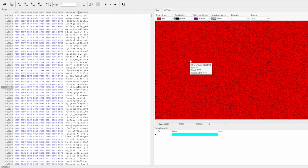It's also got ECC scattered throughout the memory. Again, they need a lot of ECC because these memory chips are so bad. They fail behind the scenes. They don't last long. And the ECC, I'm not sure what the structure is for the ECC for this chip either. So I have hit a wall. I'm trying to think what to do next.